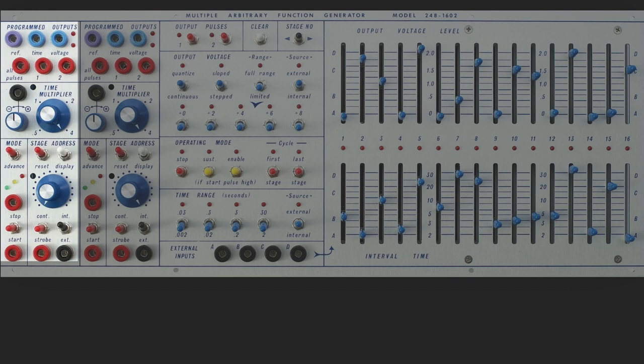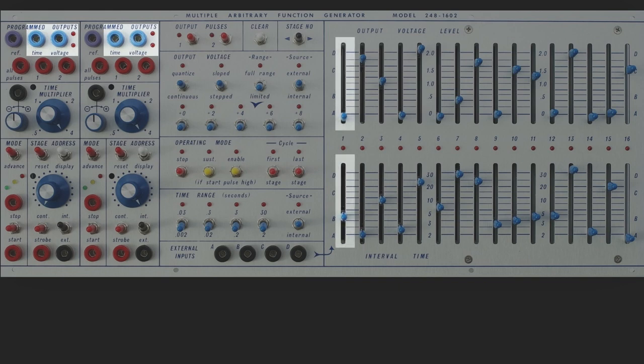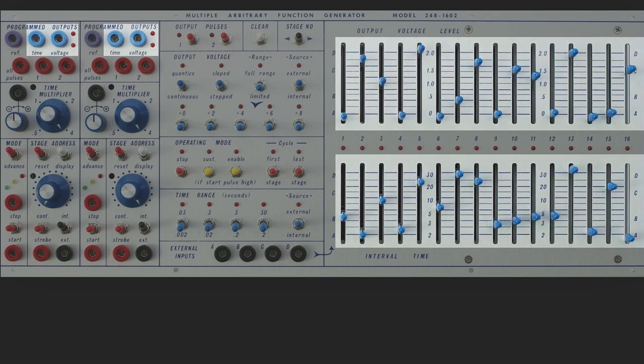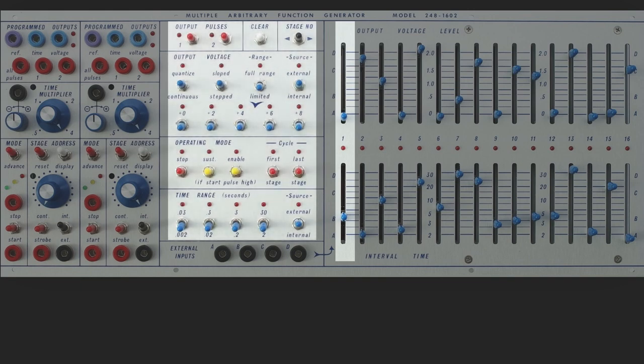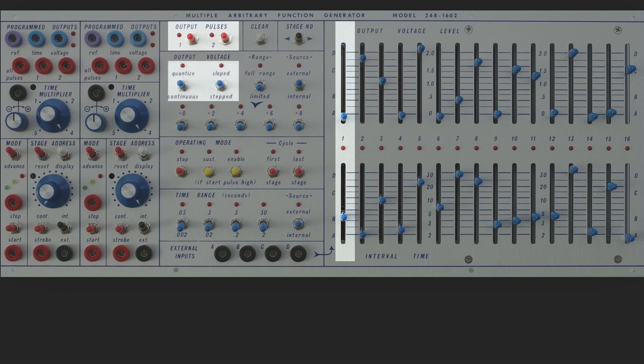Each playhead has its own clock input, manual CV address, and strobe input that samples the address CV. These two playheads can read the same two channels of 16 steps defined by the two rows of faders. Each step has its own information defined by all the switches: trigger 1 and 2, stepped or glide CV, octave switches, and sequence structure.